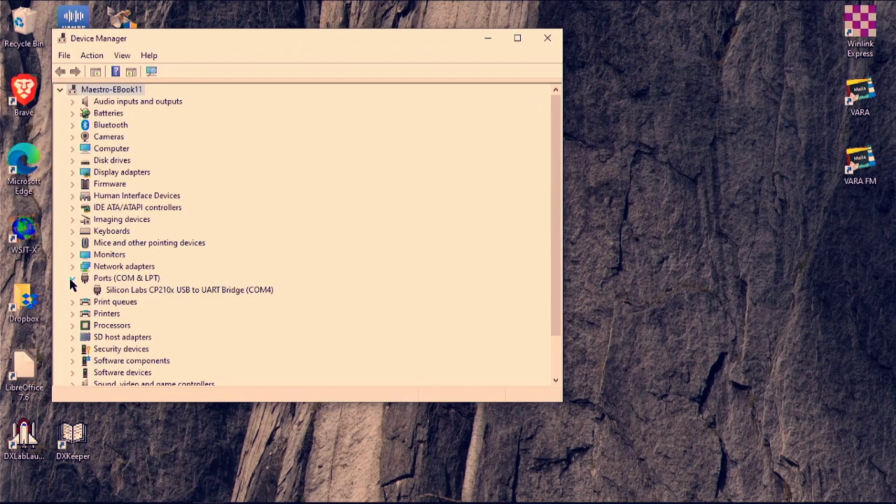And opening up these ports, COM and LPT, you'll see it is COM4 here, and it is a Silicon Lab CP210X USB to UART bridge. If your computer comes up with a warning triangle here that it's not properly identified the USB serial interface device within the Digirig, you can go to Silicon Lab's website and download the driver, and I will have a link to that download in the description of this video. In particular, you just have to remember that it's COM4.